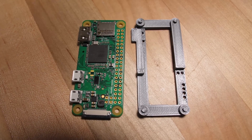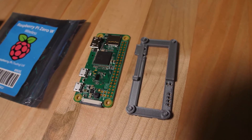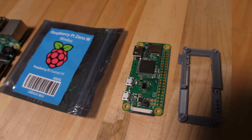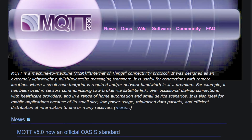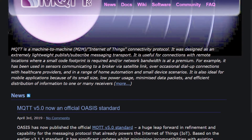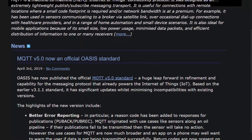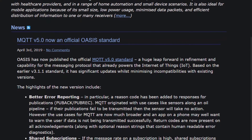The way this home automation stuff works is the Bluetooth part is really only one ingredient. The Bluetooth thing is going to generate messages for another system that stuff is happening. Like if you have a home alarm system with a panel that says door number two is open or there's motion in the basement — those sensors are wired up to a control panel and as the sensors open and close, stuff happens. There's a protocol called MQTT that is designed for Internet of Things type events like that. You could tie in things like your heater kicking on or off, your electric meter usage, or your Raspberry Pi detecting your phone's Bluetooth MAC address.